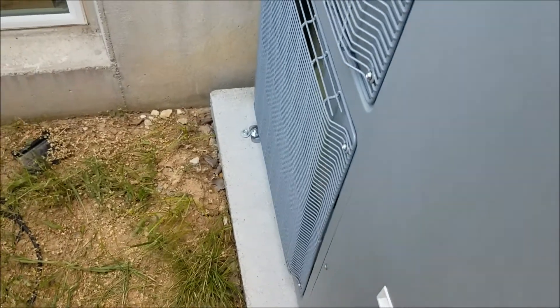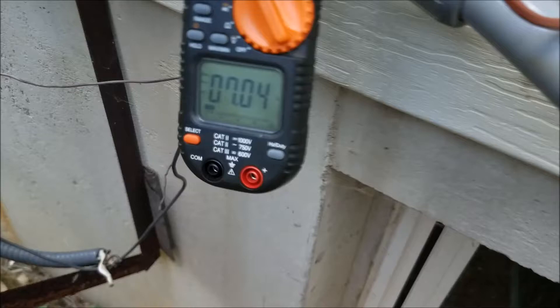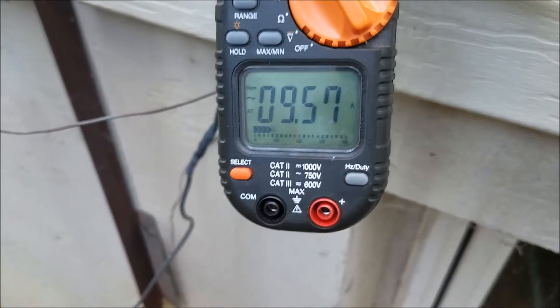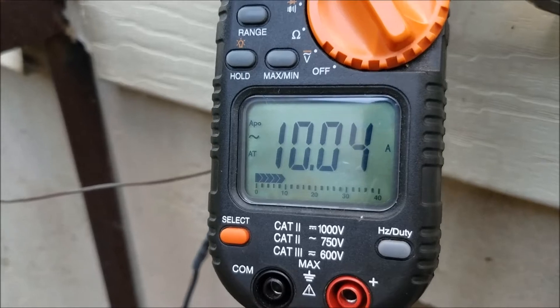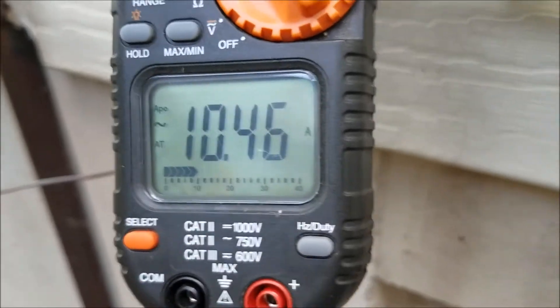Turn the air conditioner on and drop the temperature inside. One of the good things about DC inverter-driven technology is you don't have a huge surge current. When you turn on the old air conditioner I had, you'd have 4,000-plus watts being applied all at once — a huge surge current. With this system it just slowly ramps up, and that's good for the whole electrical system in the house.